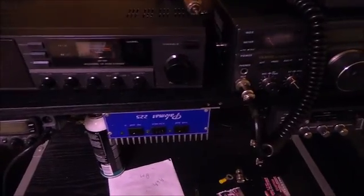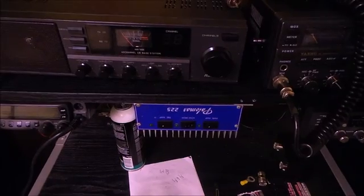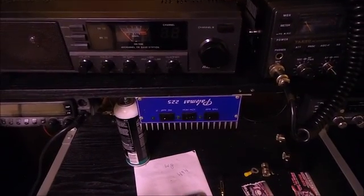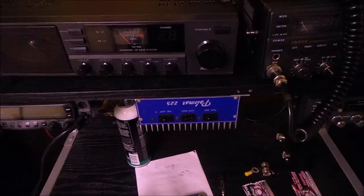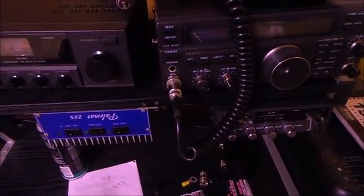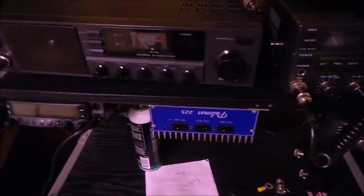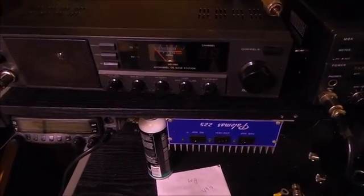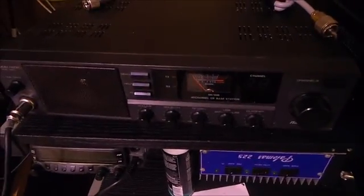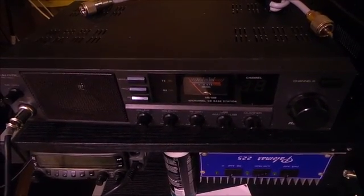With that and the choke, these radios don't cause any TVI. Like I said, 20 feet of coax coiled up in a 6-inch coil — don't overlap it — that'll take care of the RF coming back down the coax. And the low-pass filter will stop any harmonics. If you're not running an amp, hook it directly into the radio as close as you can — 4-inch coax or directly with a jumper.